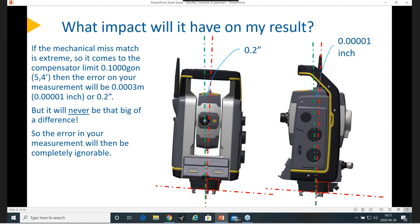This is also the same when you set up for your surveying without doing a traverse: you actually don't need to level it that accurately. It won't help your accuracy in measurements. The compensator is very, very accurate, so if you don't level it perfectly when you start, you will still have accurate measurements out of the system.